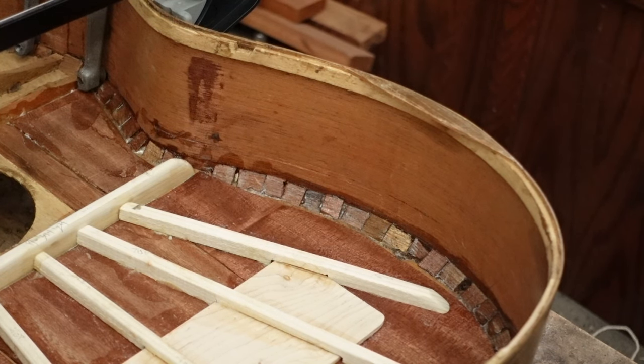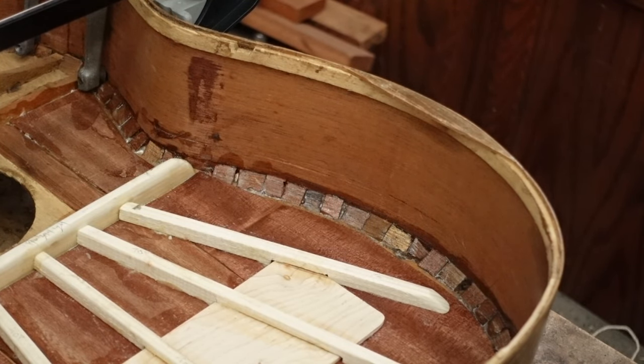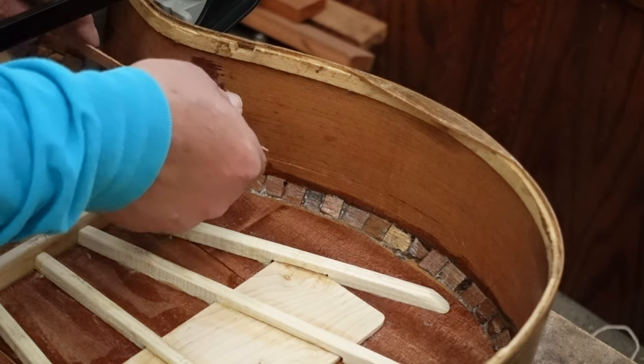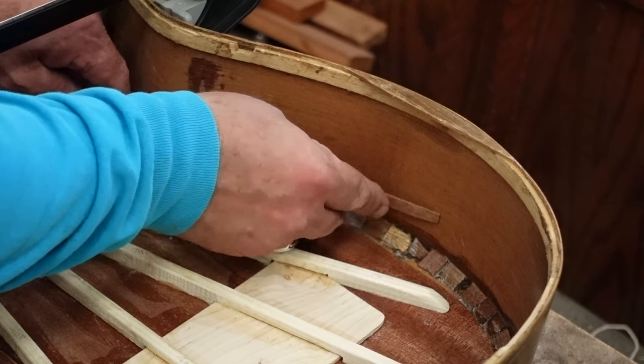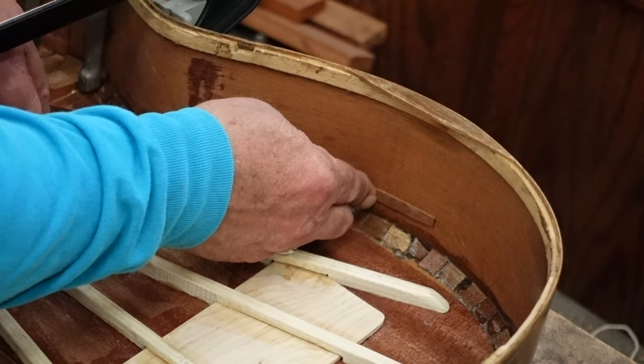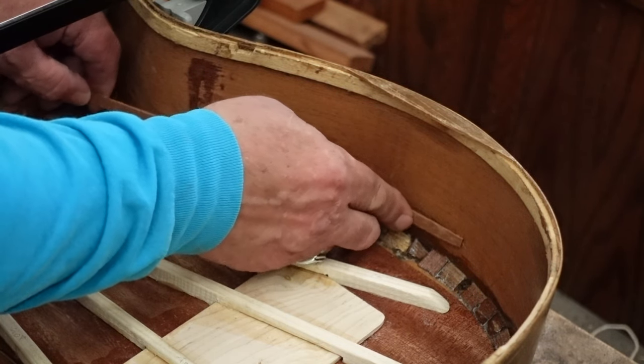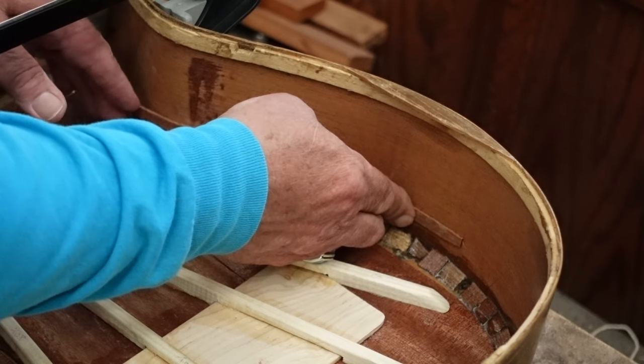So my first priority is going to be to put a piece of this 16th inch material. It's cut into a little furring strip out of the same material as this sheet that we use to reinforce the soundboard. And I am going to find the crack on that, and I'm going to lay that about right there. And we're going to do this in two separate parts, because if I try to bend this around the edge, it is going to want to crack on me.